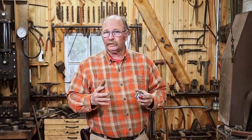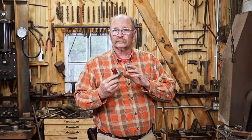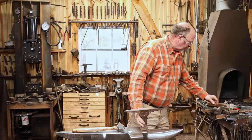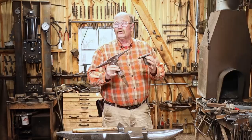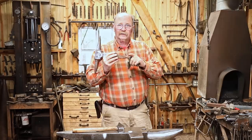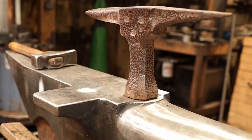I've got a lot of these tools to do — they're all going to need some little tweak or adjustment one way or the other. I just wanted to give you an idea of what I was doing and give you some thoughts on how you can correct these if you have the same issue in your shop. Some of these old tools are just too valuable — you're not going to want to weld up a fatter shank on it. You have to figure out whether that's some sort of an adapter, or whether it's just a tool you hang on the wall. In my case, that's this old stake — it's definitely too small for this, and it doesn't quite fit the adapter either. I think I'm going to try and make another adapter that just fits this, that will slip over it, and maybe put a set screw in it. But I'm not going to do any welding or grinding to this — I'm going to leave it in as much original condition as I can, because I really don't use it too much and I don't want to abuse this cool old stake.